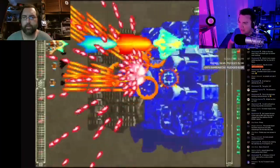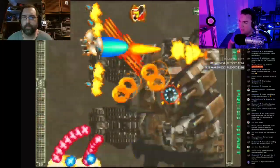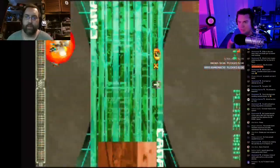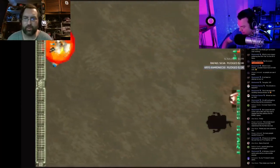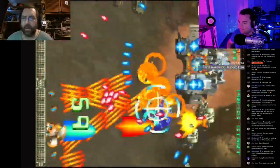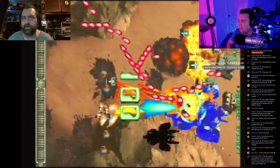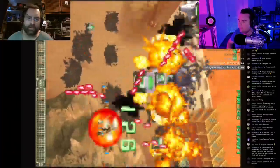How did these Cave games come to be on PGM? Right now you have to sacrifice a donor cart to make a Cave repro. Unfortunately, people were even sacrificing Demon Front. I don't have a problem making reproduction cards, but when you're destroying really cool games to do it — that's part of why Fluffy's idea is twofold: one, so you don't have to sacrifice another game, and two, all the chips are 5V EEPROMs, so nothing's been over-driven.